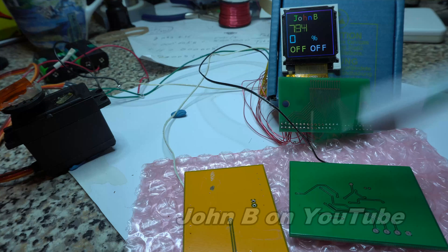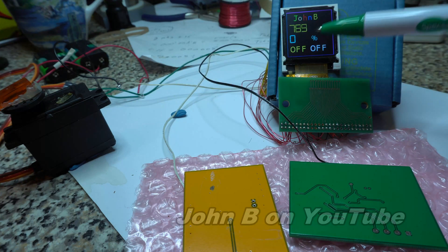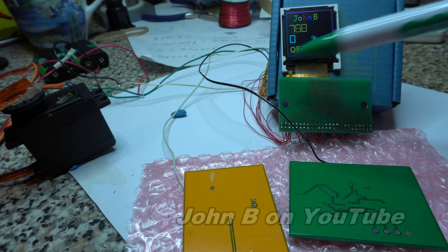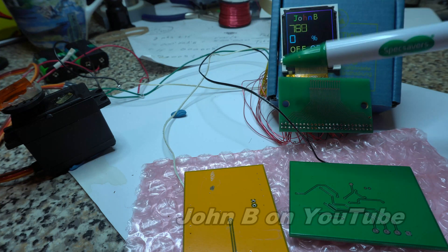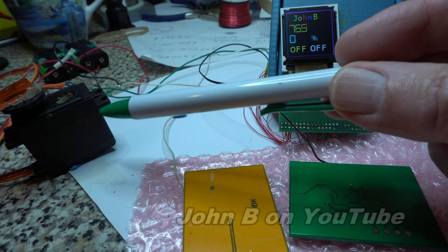By using these buttons, although we see a percentage here — 0 to 100% for the servo travel — it's actually counting to near 4,000. And in a for loop counting to 4,000, doing nothing else, just 0 to 4,000, gives me a two millisecond delay. So with the two millisecond delay, plus I already turn the port on for 500 microseconds, that's 2.5 milliseconds, which will give full travel on the servo.